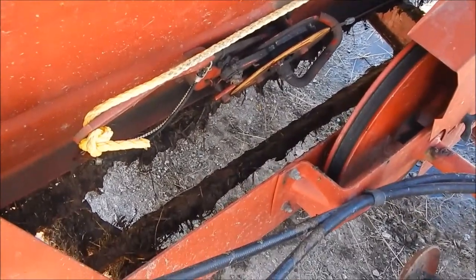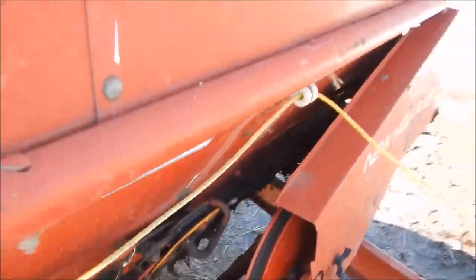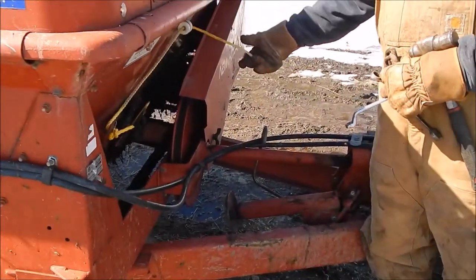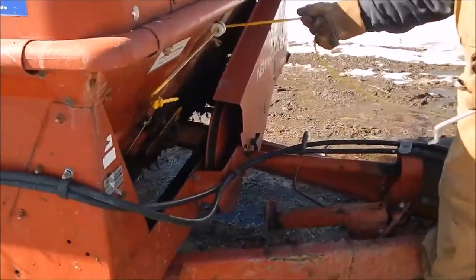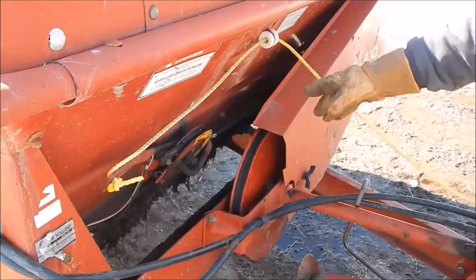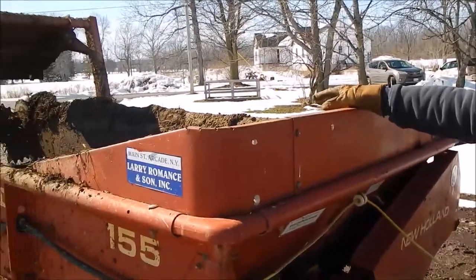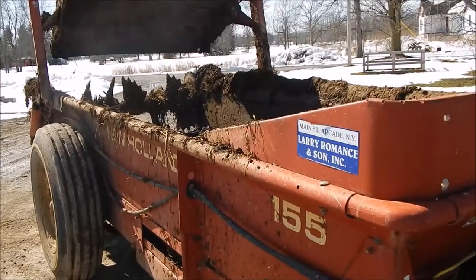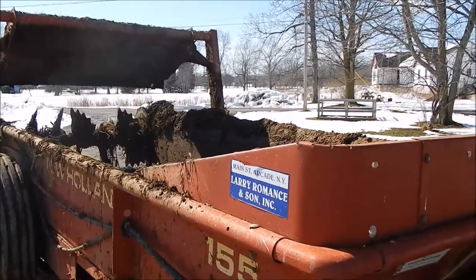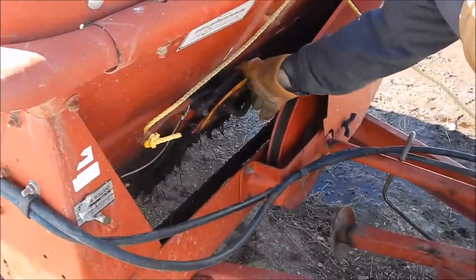That's one of the things to watch for when using this machine — that bar, what speed you're at, and that the manure pile is moving back. In this particular spreader you have to go all the way up in the ratchet to get it back to neutral. Now I'm on the rabbit and I'm going to go to C. What is C for? C is for clean out. When you get to C on this adjustment, the back beaters will stop turning. The bed chain will still be in high gear and it'll unload whatever little bits are left on the bottom. You want to clean it off every time you're done using it — don't leave any residual manure. When you're done with C, you push it and it returns to neutral automatically.